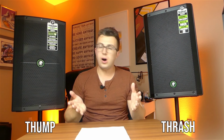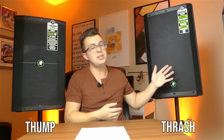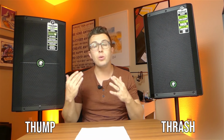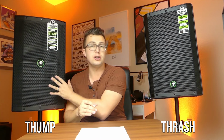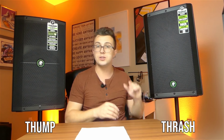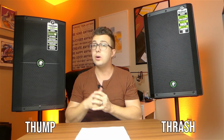When it comes to watts, the Thump has 100 additional watts at 1400 compared to 1300 on the Thrash. Really, watts aren't gonna matter that much to sound, but what does is SPL, and the Thump 12-inch version has 128 dB, which is 3 dB more than the Thrash's 125. So that's a noticeable, perceivable difference, so you are gonna get a little bit more power in the Thump.